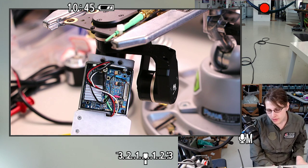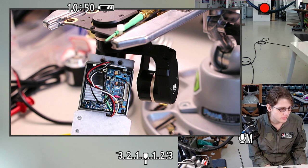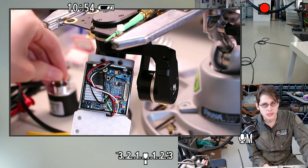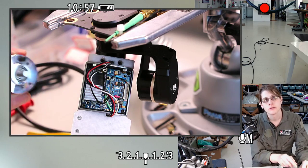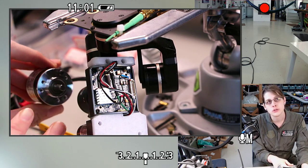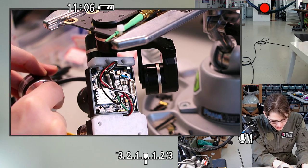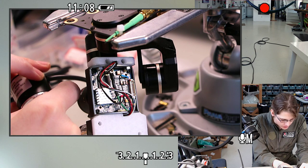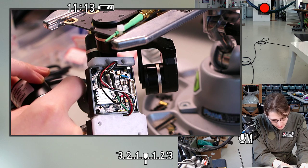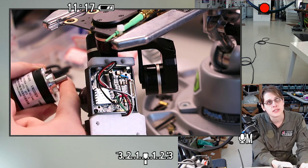From my understanding of the more physics context where you would find this, it's a relationship between rotation on a shaft and a differential in tension on two ropes coming into this kind of pulley-ish contraption. Anyway, that started pointing me in the right direction toward what shapes people actually make these out of. So I think what makes sense is to design a piece for this that's effectively a capstan.